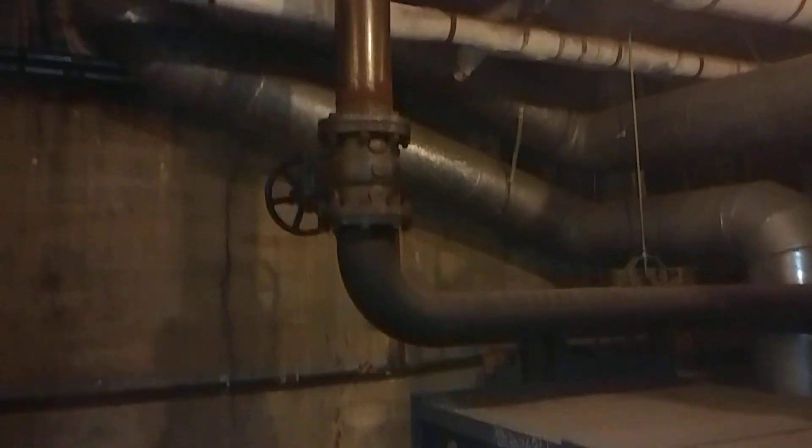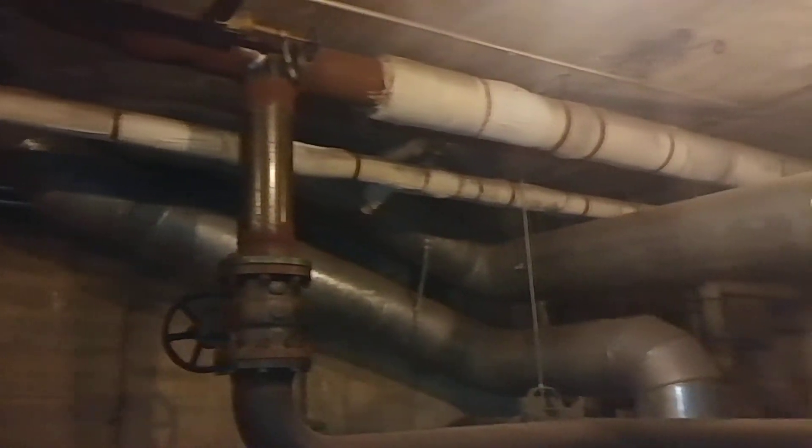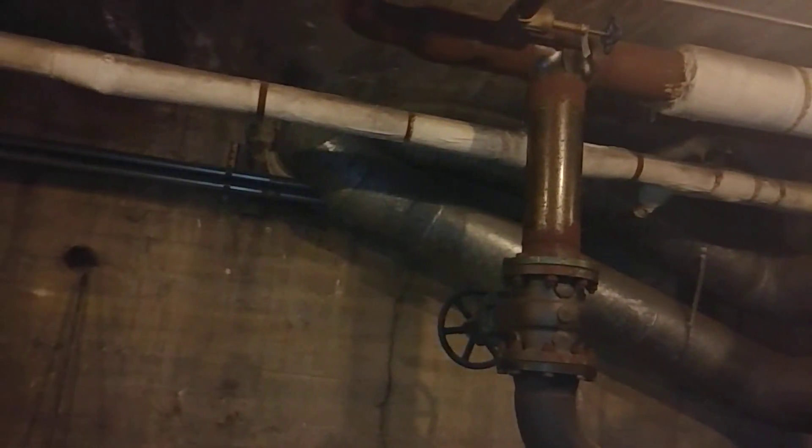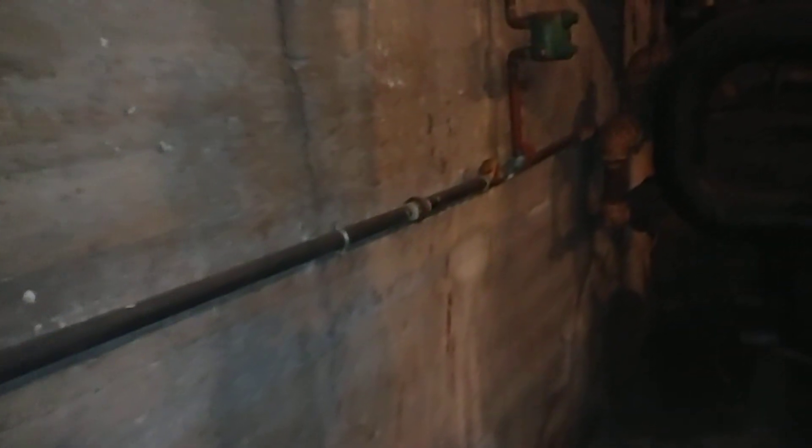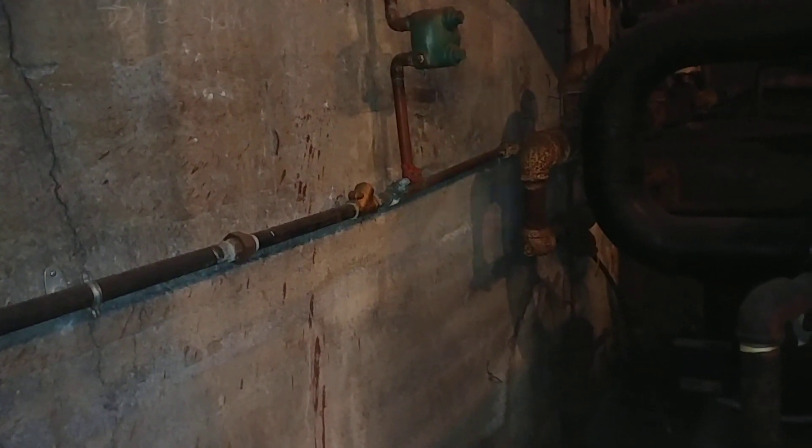And then there's your king valve, and then into your steam supply. The returns were not done very well. You can see there's a trap here, which is fine, and then there's a drip here, and it goes downhill and then uphill again. When you don't have a proper pitch on these returns, it tends to hold up water. Of course, there's a check valve there — which is like, why?